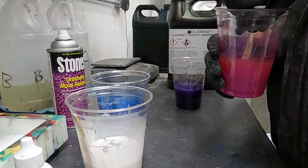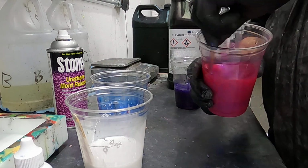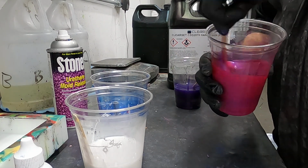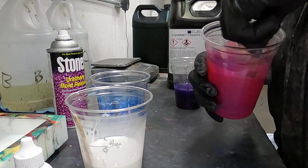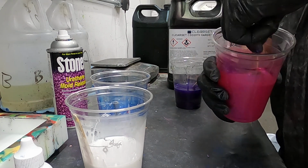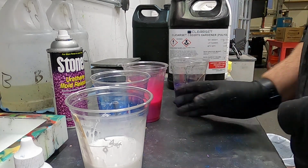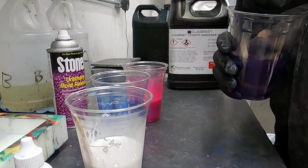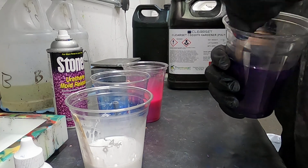And then whatever your finished product is, if you've got a pen and it's sitting in somebody's car, cars hit 140 degrees pretty easily. 160 buys you another 20 degrees of temperature before you have to worry about that finished product starting to warp. When you're shipping blanks in the summertime too, you don't want your blanks to show up and have them be curved. So that little extra heat deflection actually really helps there as well.